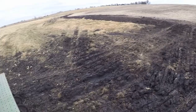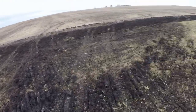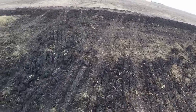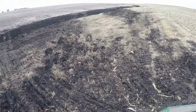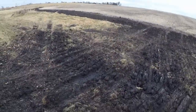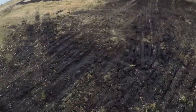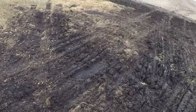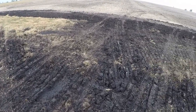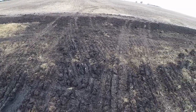So since that hydraulic hose, or the fitting on the hydraulic hose that I broke, is just for the depth control on the coulters, I decided to just keep running since I don't have very much time before conditions get worse here. I was able to kind of knock it back together so that it won't get dirt in there, and I'll just have to leave it where it's at, which is kind of full depth, which is maybe not completely ideal in some spots, because we run the risk of stirring things up a little bit more than maybe we would ideally want to. It's perfectly fine for this area, because it's all mud and was torn up where I found the wet spots earlier.